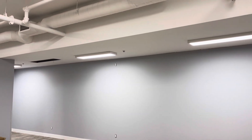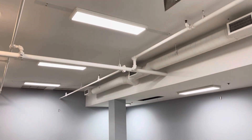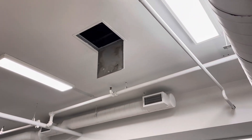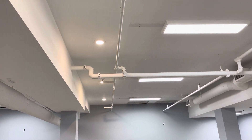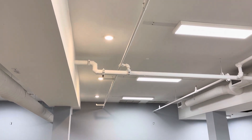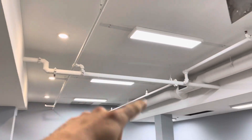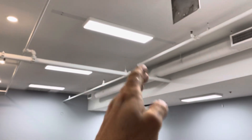Hey guys, welcome back — this is just a little update on one of the rooms where the electrical lighting system is done. I have fully converted from 347 volts single phase to 120 volts, except for the spotlights, because the spot side were already 120 volts on an independent circuit which I isolated and managed to put in parallel with the row of lights that corresponds.